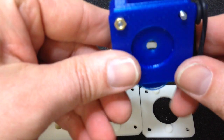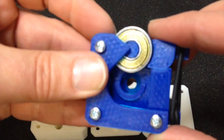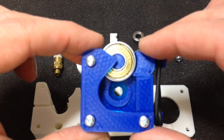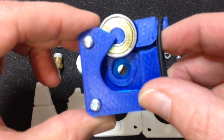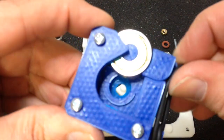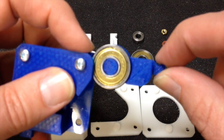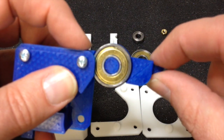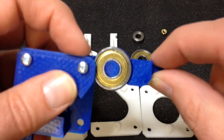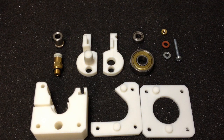This is the one I have been using up until now, and this is the one that printed these white parts down there. Its design is very simple. The idler gear is held by one of the screws of the stepper, but it has one big disadvantage because there's not a lot of leverage from the spring that pulls it together compared to the bearing pressing on the drive. You usually end up having a little bit of slippage on the filament. The bearing just doesn't have enough pressure, so the better idea would be to have more leverage and to exert more force. That is why I designed this extruder.